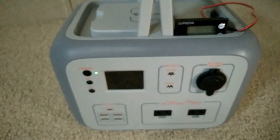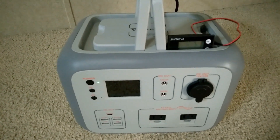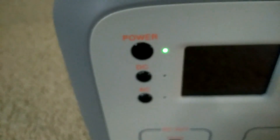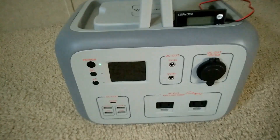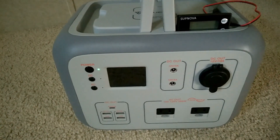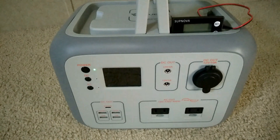Here's the tip and it's actually very easy. Before you go to bed or before you plug in the solar for the morning, just turn the DC on — that's all you have to do. You could turn the AC on as well, but turning the DC on uses a lot less power. The idea is to keep the unit on and active while using the least amount of power. On this BluEtti, just turn the DC on, and when the sun comes up the MPPT will wake up and start charging with no issue.